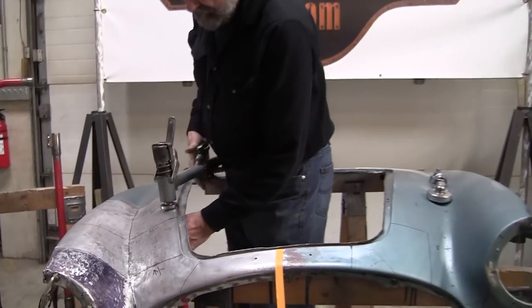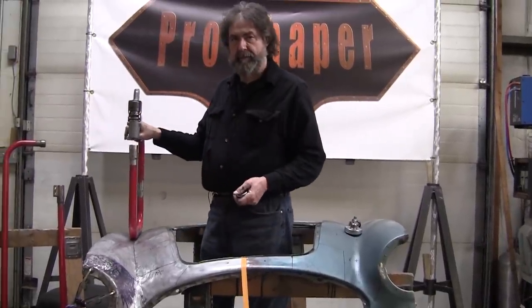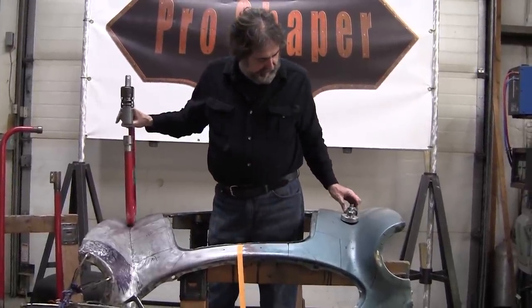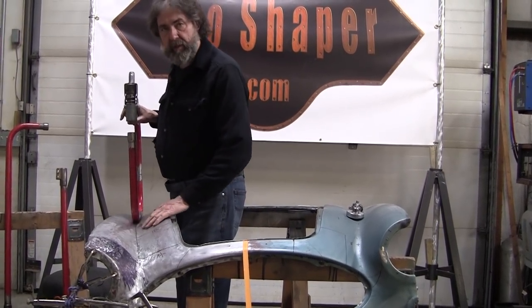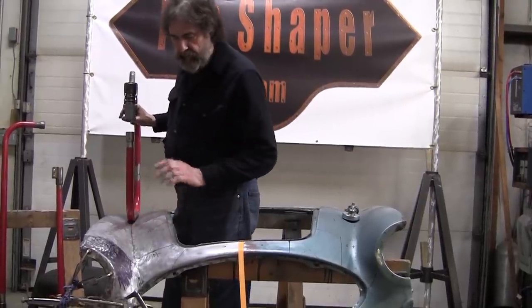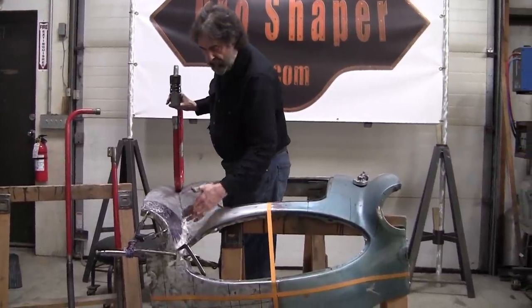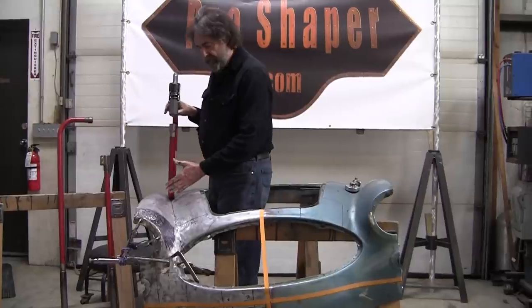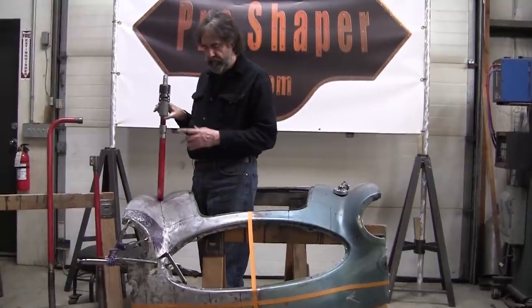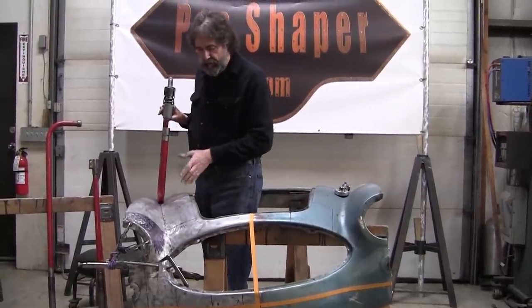So what I'm trying to say here is you can do it a bunch of different ways. You can do it with a simple slapper and dolly, or a hammer and a dolly, or if you've got an air planishing hammer, you can use that — but this isn't as user-friendly going through that valley as that wheel will be. So to have the full array of tools to fit the situation is the best, and if you don't, you're going to have to use just the slapper and the dolly. And to get that all ironed out with the slapper and dolly is probably going to be a minimum two or three hours. And if you're really crazy picky, it might be five hours to smooth that all out, whereas you might cut the time in half or even a quarter of the time if you use the mobile English wheel or the air planishing hammer in the right way.